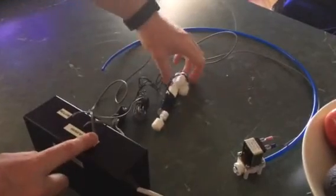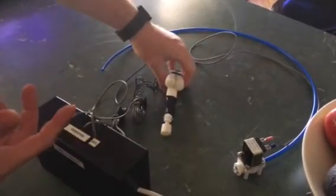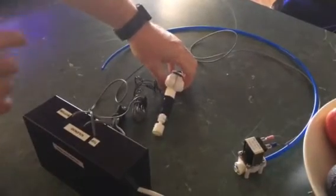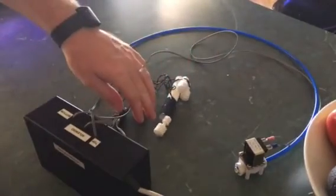The top float switch has two float switches. The only reason for the two is an emergency, just in case one somehow sticks — the other one will turn it off. Either one going up will turn it off, and the bottom one is what switches it on.